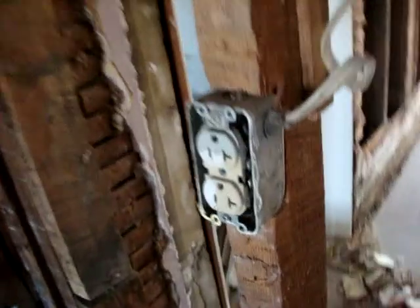This is another example of some pretty shoddy work. You'll notice this cord is all crazy and looped up — basically they just shoved it down the wall with some fish tape. When they put in a modern box, you can see where they kind of notched the stud to get it sort of flush, and they brought it through an area of the plaster — just real sloppy. This is the kind of thing that happens: the insulation gets damaged. It's just really bad work.